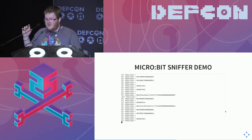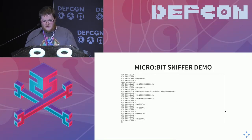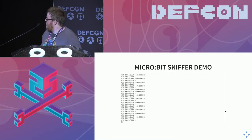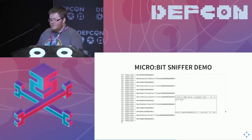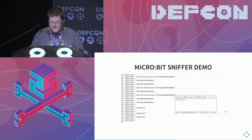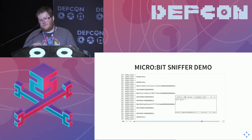This keyboard sent encrypted frames, so it is not sent in clear text. So this is good. But if I open a notepad and type with my wireless keyboard, you can see there were a lot of packets exchanged between the wireless keyboard and the dongle. By doing this, we can spy on wireless devices using the ESB protocol.